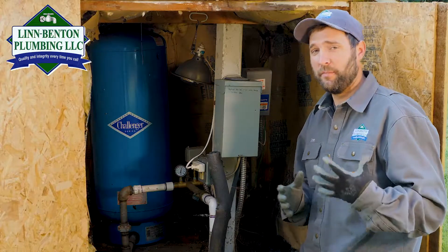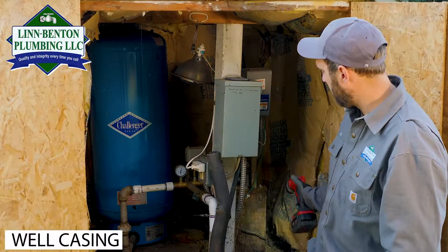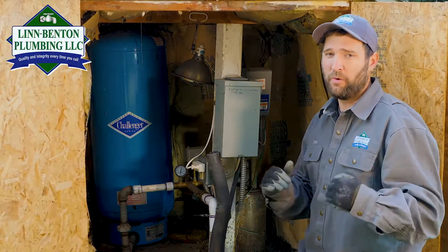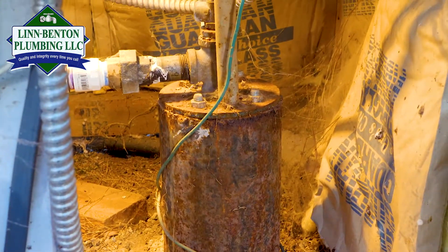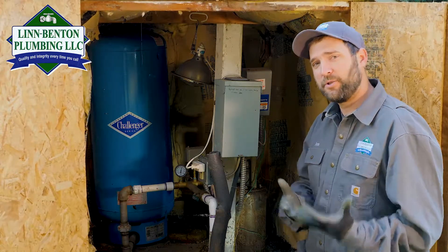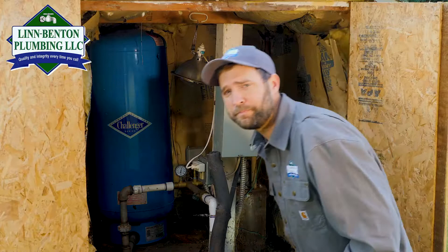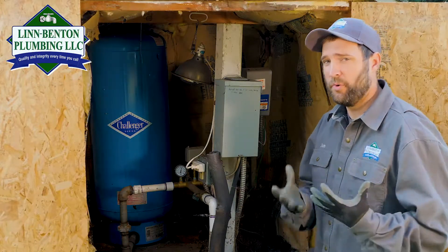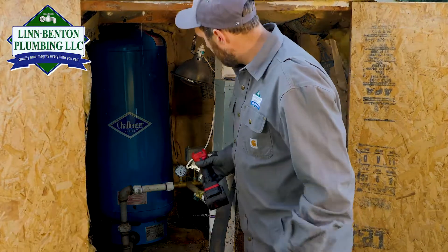The first component I want to talk about is your well casing, which is back here. That's basically a pipe that goes down into the ground that protects your well from groundwater getting in and contaminating it with bacteria or other germs. In this case our pump is a submersible pump, so it's submerged down in the well — there's very little chance of that freezing. It stays around 50 degrees year-round down there. Sometimes if you have a really shallow well you'll have an above-ground pump, and in that case you'd want to make sure that doesn't freeze.